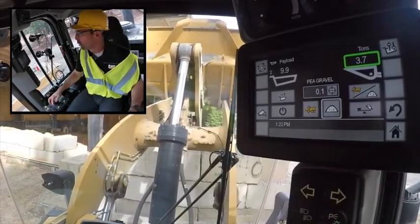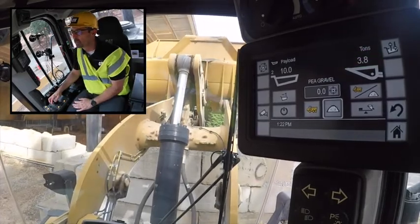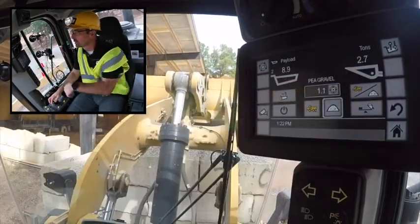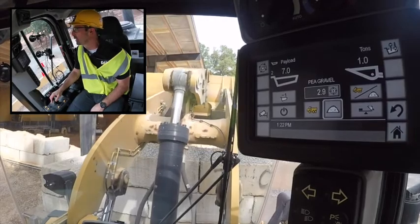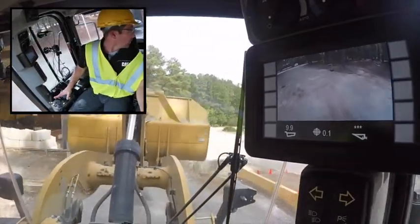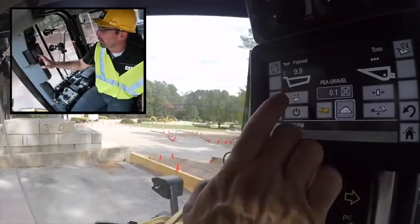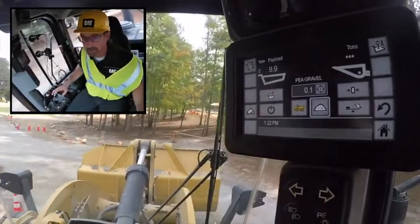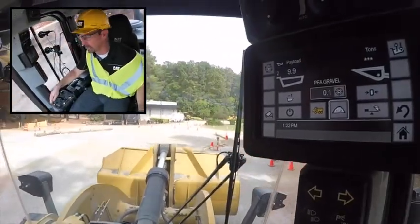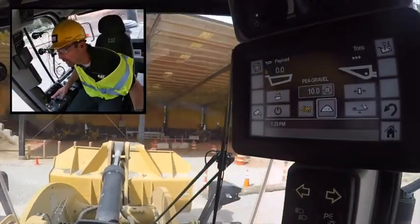In this case, our target was 10 — we're right there guys. So I'm satisfied. I'm going to go ahead and tip that material right on the bucket. It is metering. Remember, if I'm at my target, I want that to lock in because I don't want to make any more adjustments. So I'm looking for those asterisks — there they are. I'm done, back on my way, and get this job completed. So what does completion mean? I can either clear all this data by hitting that equals-zero button to clear it all out, but this is good data — I want to store it. So I'm going to hit my store switch, and you can see that whole display resets right back to zero. I'm ready for my next job.